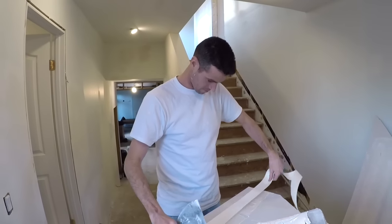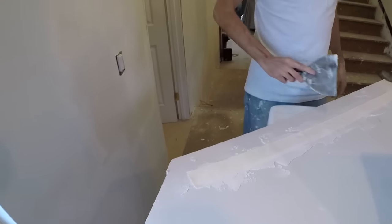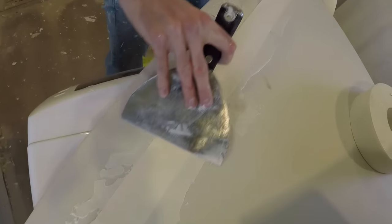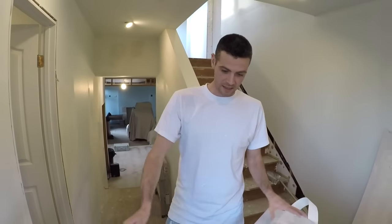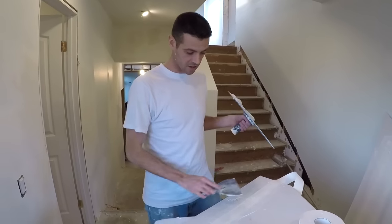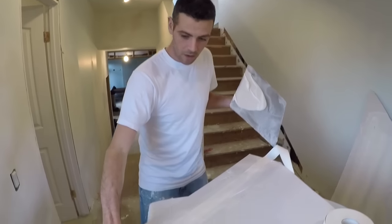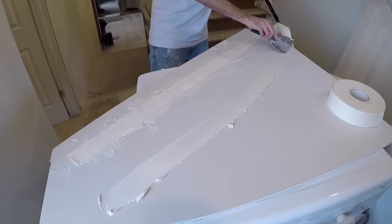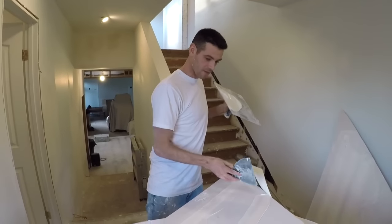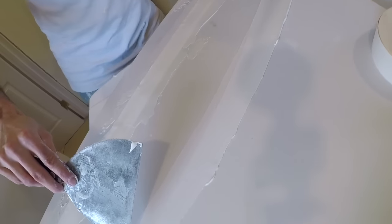Okay, let's put that on there. Already I'm starting to get too much mud, so we're just going to leave it like that — even though it's brutal, we're going to leave it. Okay, so we've got this one which is just an uneven spread, really bad. Let's do another one where we don't have enough mud put down — somebody's trying to get a nice even layer but not putting quite enough mud. See right here how there's actually no mud; that could really easily happen to somebody.